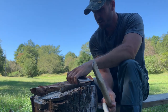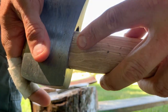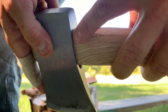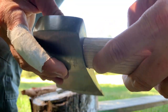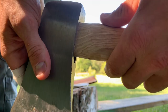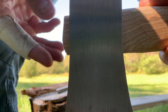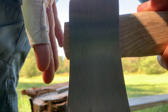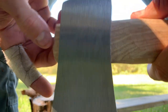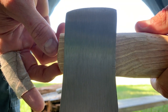That's about as far as I feel comfortable doing that. Let's see if you can get a glimpse of that. There's some peelings, the curlings of the wood, and that's good. I'd like to see that kind of all the way around as best I can — that way I know it's seating really well and there's no spaces, no gaps, so the head can't work loose. The more I pound it on there, the longer this is going to get and I can't trim that obviously without any other tools once this head's on there. So I might just leave it long and see if I can get a wedge to start in there. Let's go ahead and just go for it.